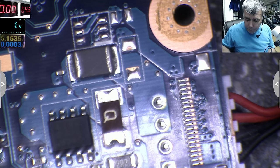If you have voltage here, after these two MOSFETs, if you have 19 with the charger plugged in, you have to stop. On this point, you stop and you go searching for the 3.3 volts power supply. Yeah, but that's a different story. So I'll plug the charger now and we will check together again the voltage, same with what we did. We just identified where the plus is going. So now we'll see if the plus is going through all these components, because it has to go. Yeah, it's a must. So I'll plug the charger.